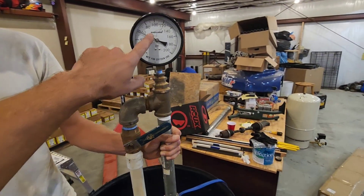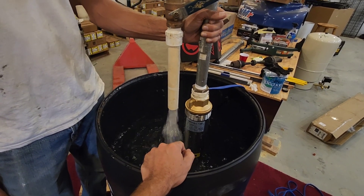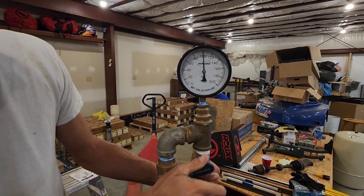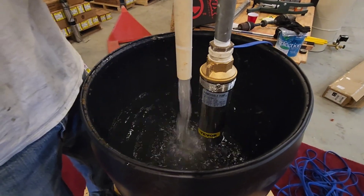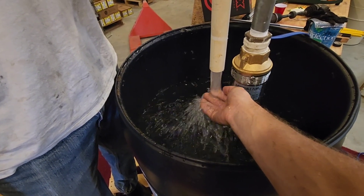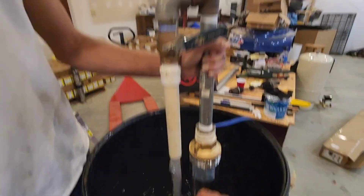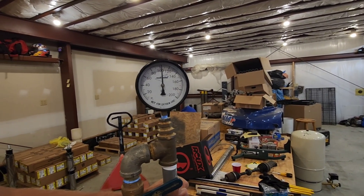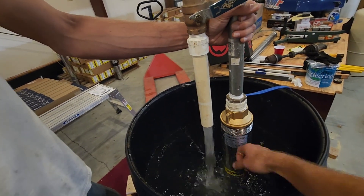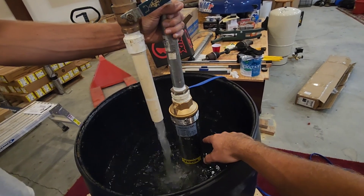That's typical house pressure — 60 PSI. And we're still getting, I would estimate, around 13 to 15 gallons per minute. Even at 100 PSI of head pressure, we're still getting really, really good flow. If I were filling a five-gallon bucket, I could do it in about 30 seconds or less — so that's still around 10 to 12 gallons per minute at that head. At 100 PSI, that would be equivalent to 200 feet deep in the well, and this pump is still giving us high volumes of water. It's incredibly efficient, and it's amazing the motor is capable of running off a 110-volt, 3,000-watt generator.